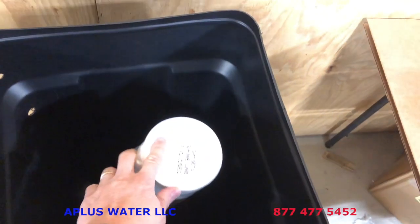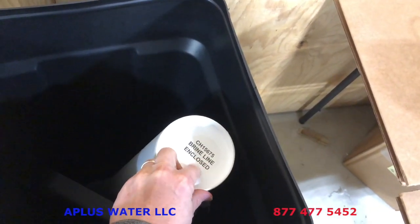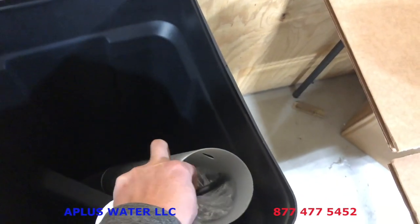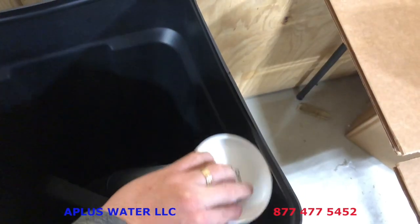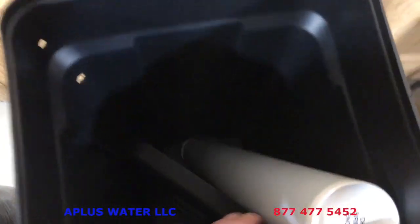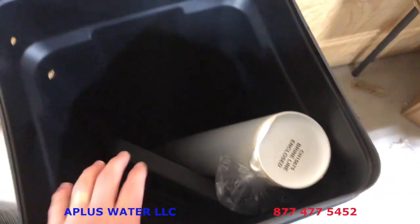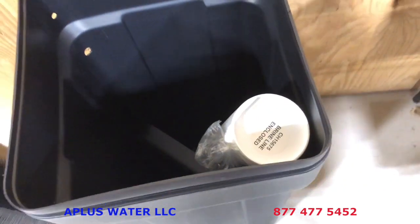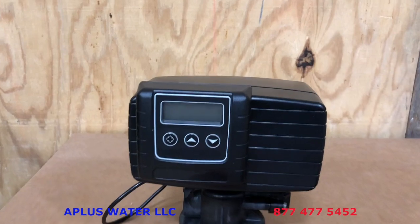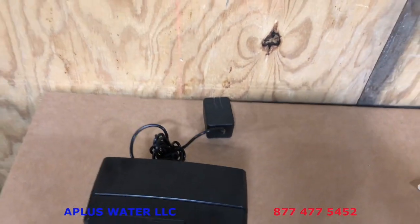It's gonna have the safety float brine well. The brine line is inside there — a 3/8 inch outer diameter tube we'll get to in a few minutes. They also have the lid in there with an overflow elbow for the salt tank, and also in there will be some other smaller parts. Of course you will have that Fleck 5600 SXT control valve, the metered softener valve with the transformer.